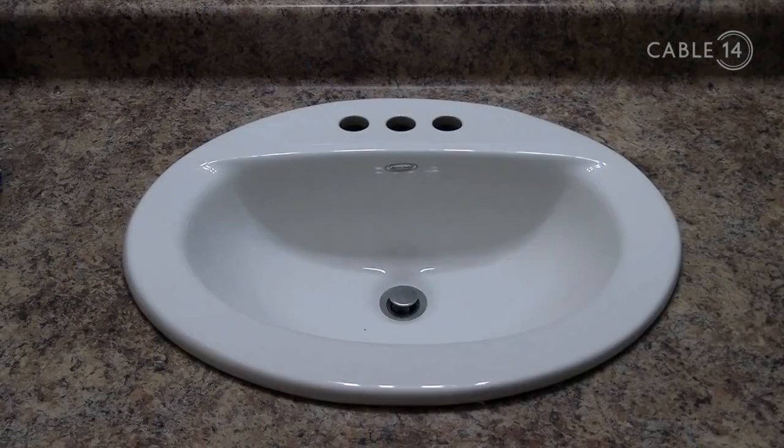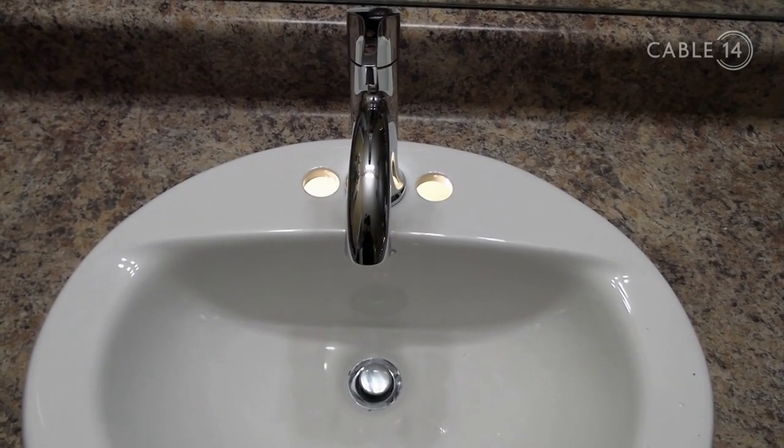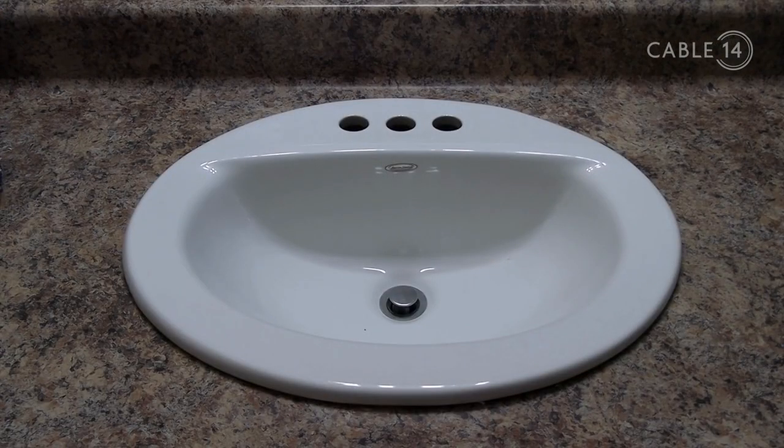Let's talk about the variety of sinks you'd be installing your faucet in. As you can see, this is a three-hole sink. Some have a single hole in the center — the design trend these days is a single hole, so the faucet rises neatly out of it without needing an old-world deck plate. However, if the sink has three holes, you must install the matching faucet, which would have a deck plate. Make sure you know what type of sink you have or will be purchasing.